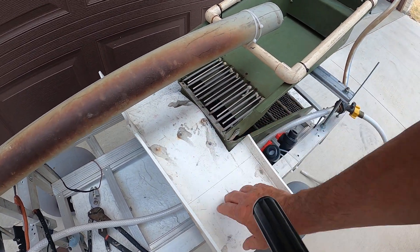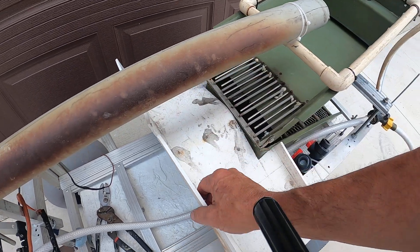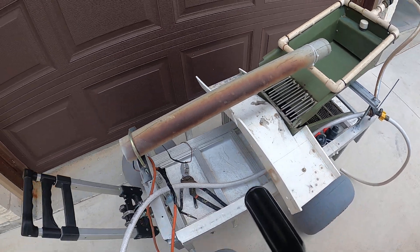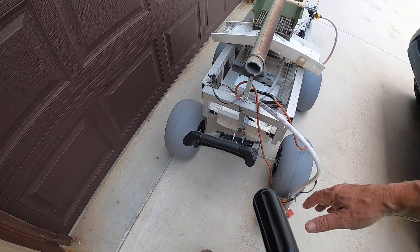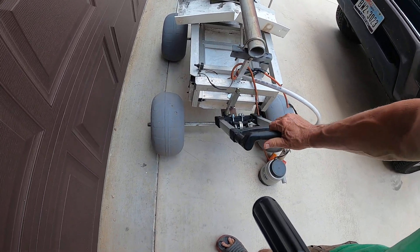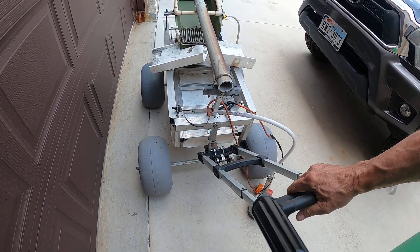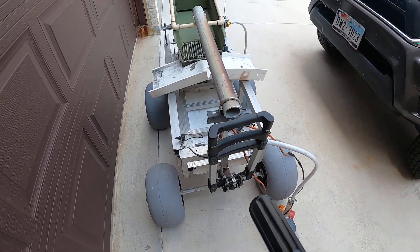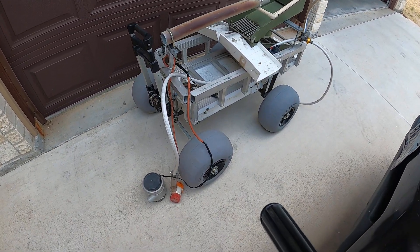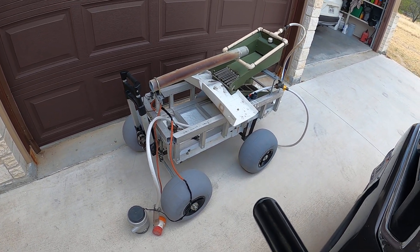For my trough, I've got my little grizzly right here. I took a piece of cutting board and just put an arch in it right here, screwed it down, and bent it up a little bit so that when the tailings come off they go right off up front. Just stuff I had laying around. There's a little expandable handle right here — you can pull it out, turn your axles, no problem, then put your handle back down and push it out of the way.